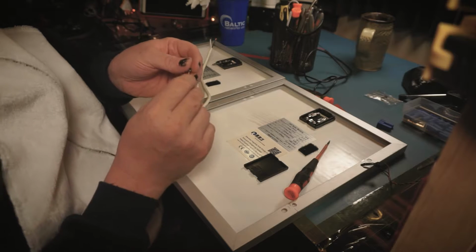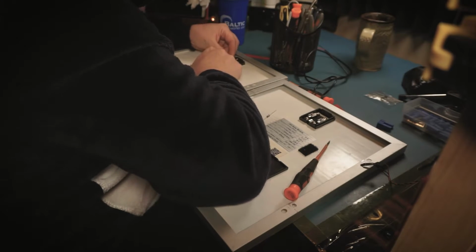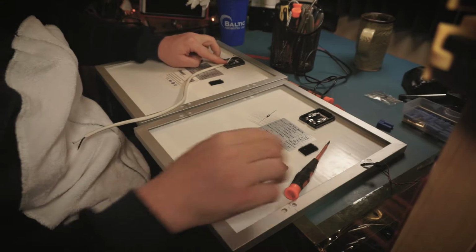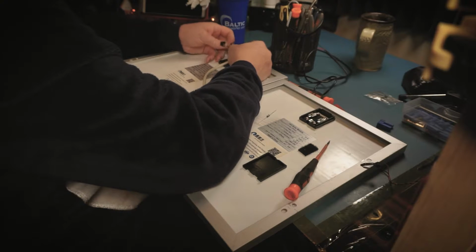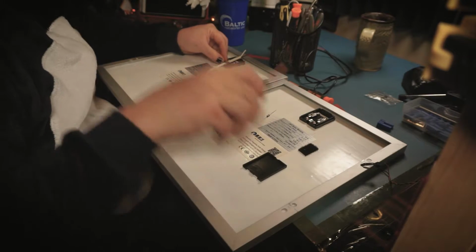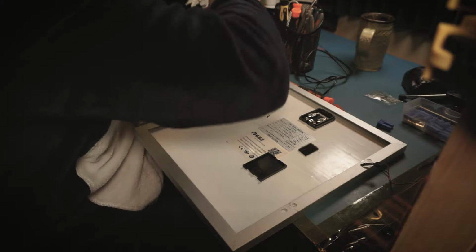And with your diode, the ring goes in the direction of the current flow. So I'm just gonna first add this little guy here like so. This little cable is just some old lamp cord that I had lying around, and it's the right diameter to fit underneath these connectors, so it works well. Let's see here. Let's tighten this down a little bit. Oh, what about the screw for that one? See, this is just me having a day.